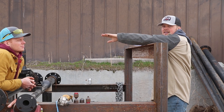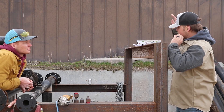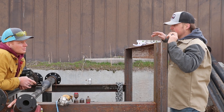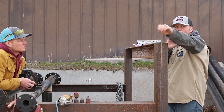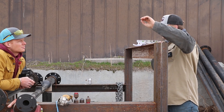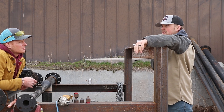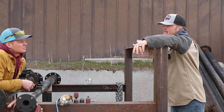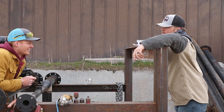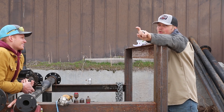7/16 is a long ways. As you start shooting longer and longer distances, that's going to transfer into a lot bigger measurement. You have to start being super accurate with your levels and making sure everything is spot-on, because if you're shooting out 20 feet and you're 1/16 out here, then by the time you're 20 feet out, that's an inch and a quarter out of whack.